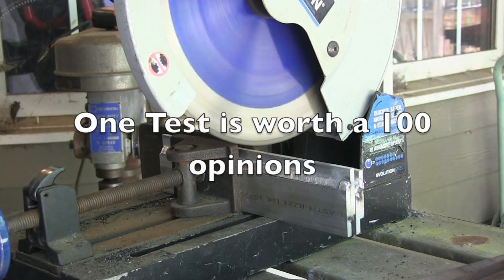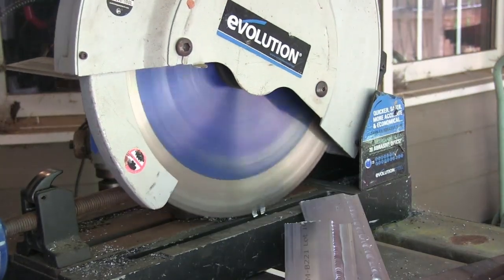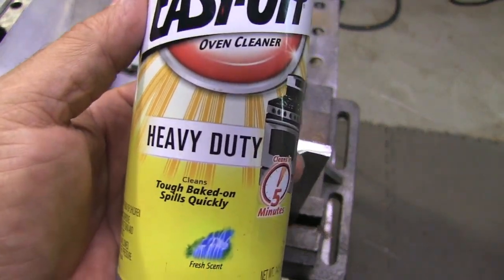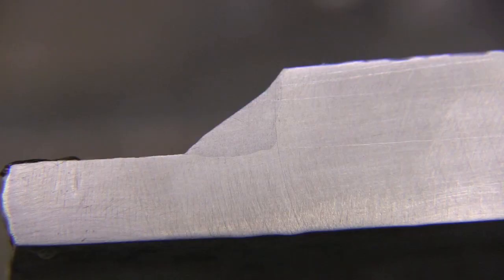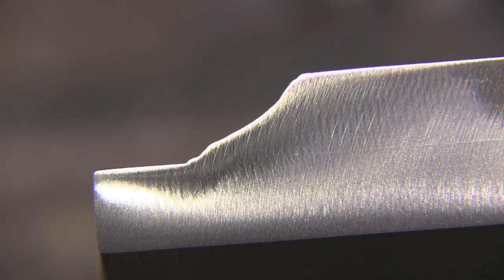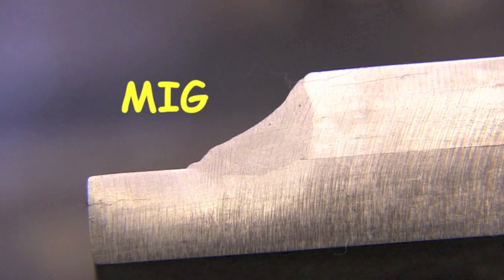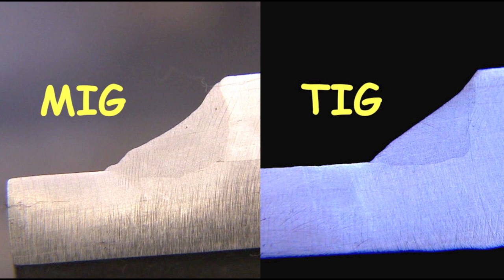We're going to chop both welds right around the middle, then do a two-step polish — basically 120 grit followed by a Scotch-Brite pad. The more you polish the better, but you can get a result with just a little bit of polish. I'm using Easy Off Oven Cleaner — a good easy thing to have on hand that does a pretty good job of etching aluminum to bring out the difference between the weld nugget and the base metal. That's the TIG joint — nothing glaringly wrong there. The MIG weld shows just a couple of fine pores, a little porosity, but penetration is pretty good. Not hugely different than the TIG weld. Aside from those two small pores, the welds are very similar, and the time is not hugely different. It's just good information to have in making a choice on which process to use.